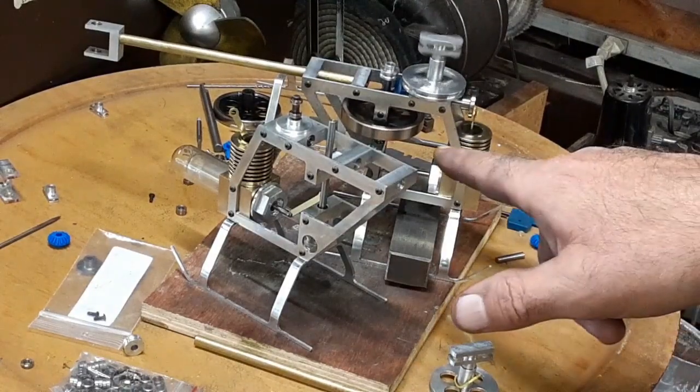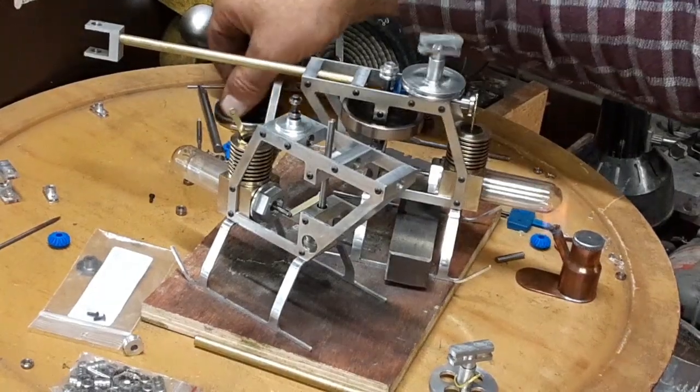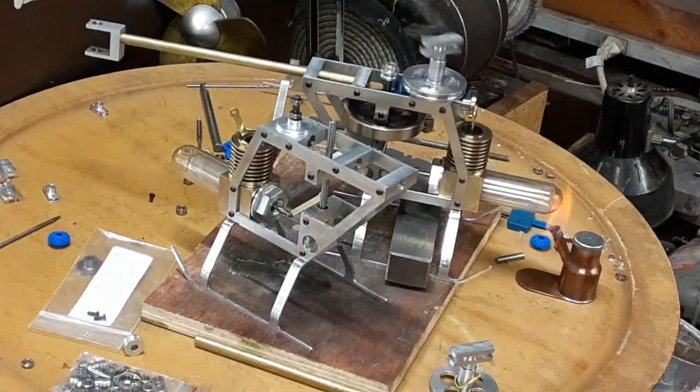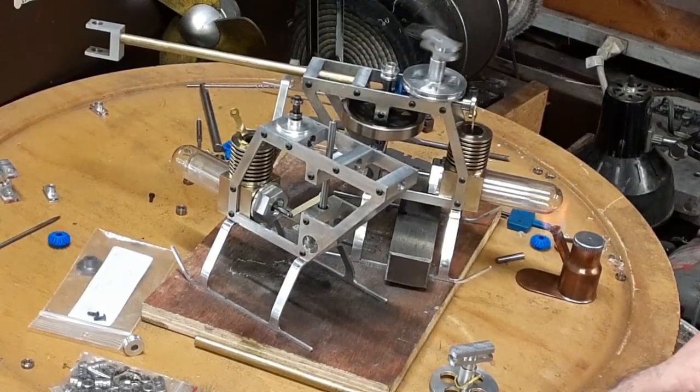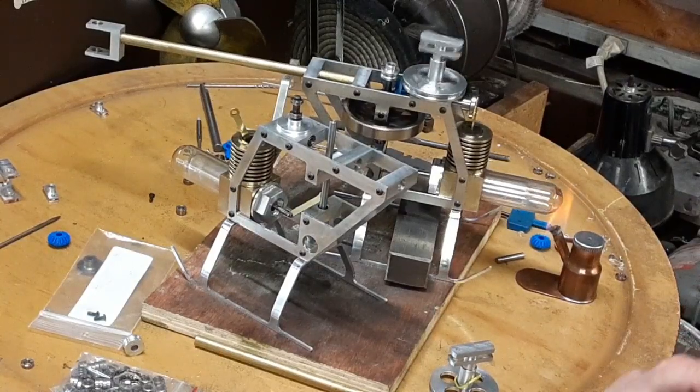And I would kind of like to take it apart just to try to straighten that flywheel. Although I hate little motors where the flywheel is wiggling, because that draws your eye there. I could have sworn that I clamped on this and turned that, and I think everything out here is running true to the OD of this, not the ID.